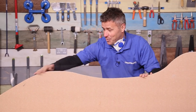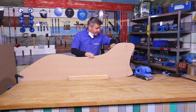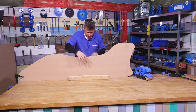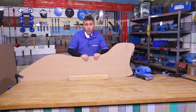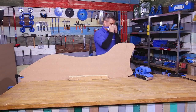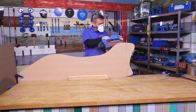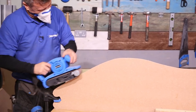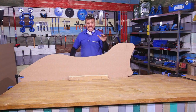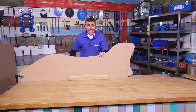All we need to do now is polish these edges off. Once you've cut it out with the jigsaw and you're happy with the shape, belt sand all the edges to get them nice and smooth. To make it a little bit safer I've screwed a couple of battens either side to hold it upright, and also used a clamp on one end so it's nice and sturdy. Once you're completely satisfied with the shape, you can use it as a template to cut your second side.